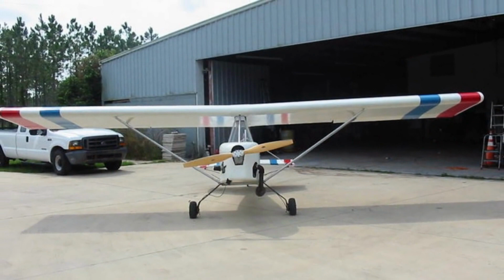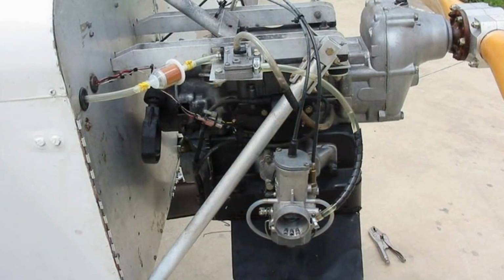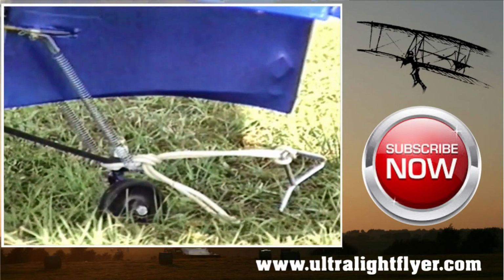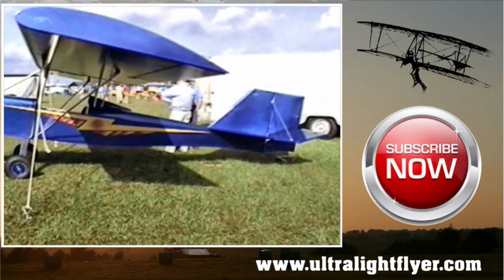Cruise comes in at around 60 to 65 miles per hour depending on engine and prop combination. The original designer, Scott Land, reports that he got the best performance with the 35 horsepower Kawasaki liquid-cooled engine. He was swinging an Ivo prop with a 2.8 to 1 reduction drive. Top speed was 75 miles per hour at 6,650 revolutions per minute. His cruise was 60 to 65 miles per hour at 5,800 revolutions per minute.